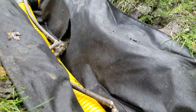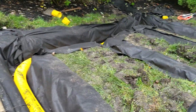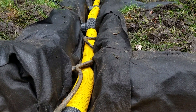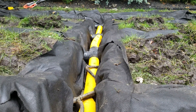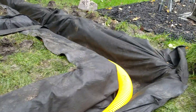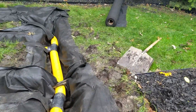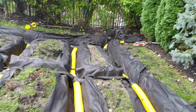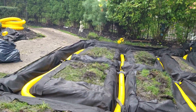You have to go under the sprinkler pipes. It's okay to put the pipe right on the fabric when you're using geo textile non-woven drainage fabric — you can set the pipe right on it. The guys that aren't using a geo textile fabric have to put stone down first; you can't just set the pipe down on the dirt, that's going to be a problem. So we have four pipes running in this direction.